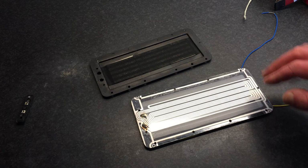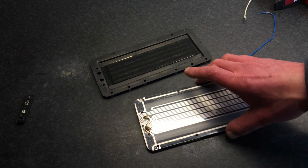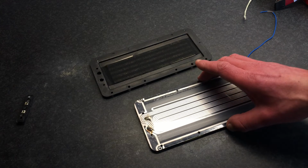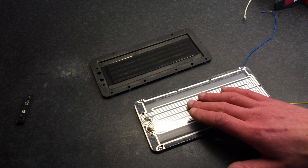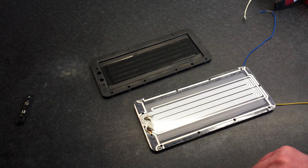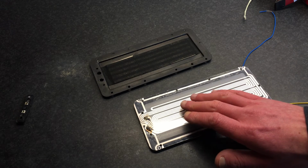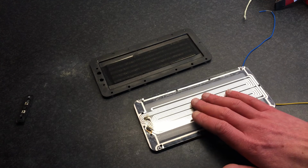So they used, I think, something over the coil as well to shield it or protect it against corrosion, I don't know. But on the other hand, aluminum would be kind of safe for a pretty decent time. So I'm not sure why they did it. Might be the weight itself and the fact that it protects it a little bit. So there might be 2 reasons. Maybe the foil is less noisy if you coat it with something like acrylic, or any conformal coating that is a good insulator and has more of a gummy dampening quality. It doesn't get hard. You need something that remains a bit flexible.